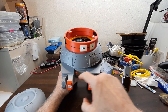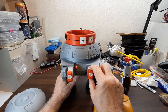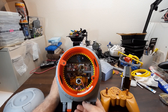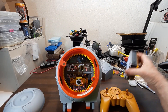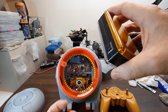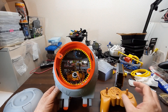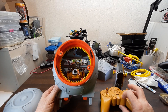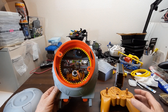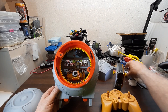These are clear filament. You can see the little slip clutches down in here — not sure if I like the way they're working. They've got an O-ring-based mechanism, just an O-ring sitting inside of a drum. I tried putting two O-rings in there but it stalled out the motor. But it does seem to be working. I thought about doing some type of magnetic slip clutch, but I just couldn't get it worked out.